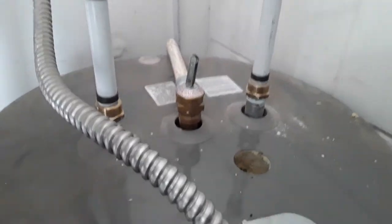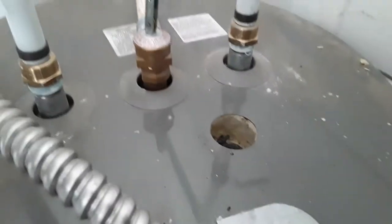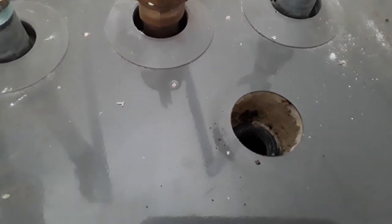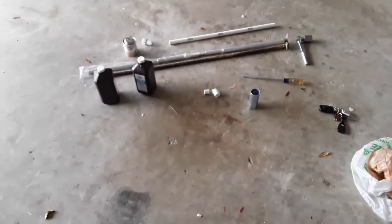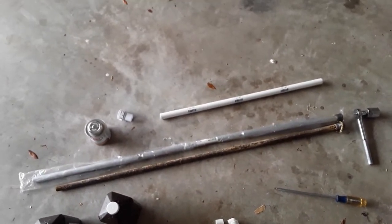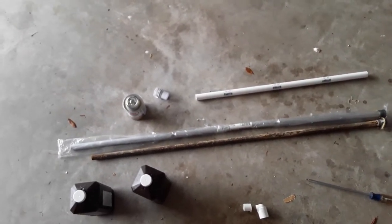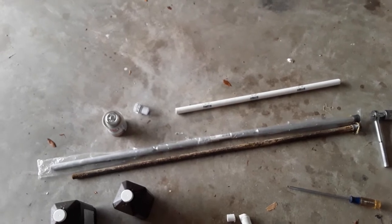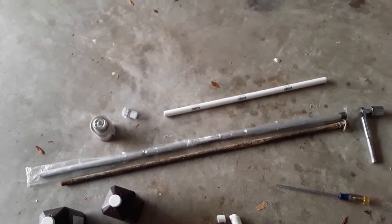The next part is I took the anode out. This is a five-year-old unit, but it was messed up when I got it — it was sitting for five months with a bad anode and a bad thermostat. You take the anode out while you're draining, and it actually lets it drain a little quicker too. As you can see on the floor, the original anode is black — it looks like magnesium. I got another anode from Home Depot. They only had one, and it's the kind you can bend a little bit. I really don't like that kind, but that's all they had.